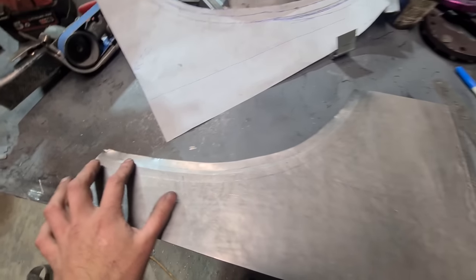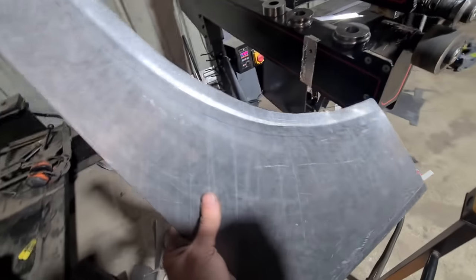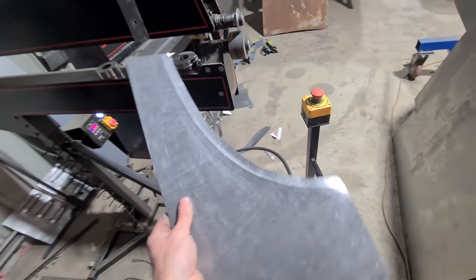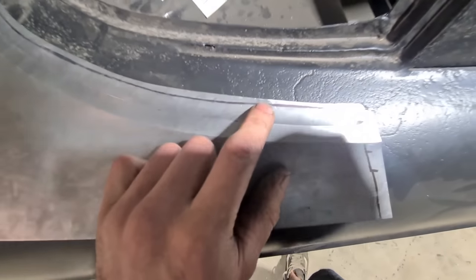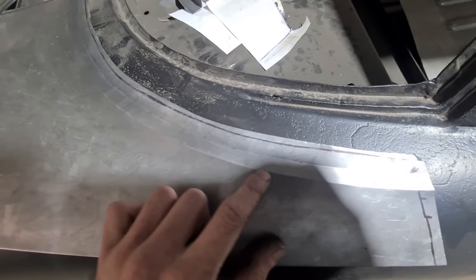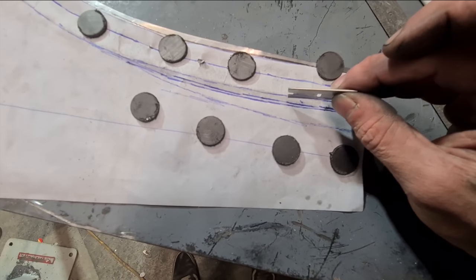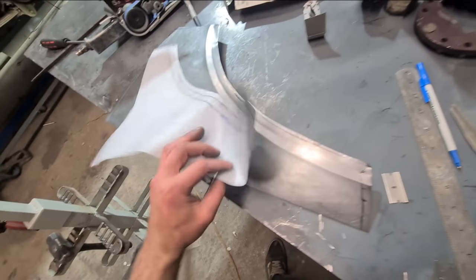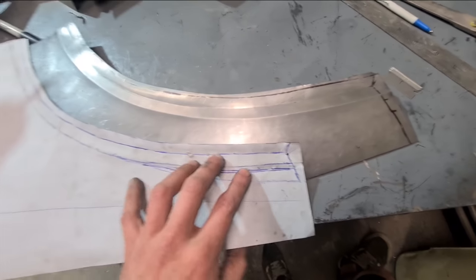Cut it out rough, marked my first fold slightly, now I've got my second one to do — I'm going to tip that on now with soft lower, sharp upper tip wheel, and run this through probably two passes. I don't want too much definition, just get them all faintly on there before I progressively turn them all over. I've marked the lines I need to transfer using a razor blade making little cuts — that way when I rip the paper off I can just retrace it accurately. This is a one-time-use scrap template.